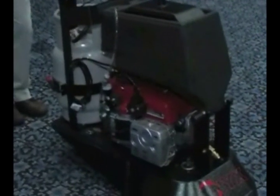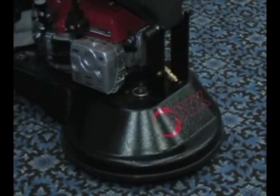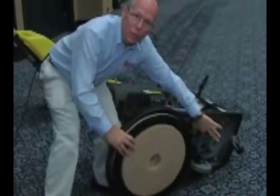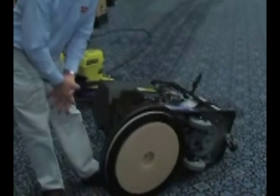An interesting piece of equipment that's come to the industry is the Carpet Avenger — it's a propane-powered carpet scrubber. You may be familiar with propane-powered floor buffers that spin at 2,000 RPM. Well, this has been geared down and modified for carpet scrubbing for large applications. We're able to clean at 6,000 plus square feet per hour, pumping the detergent onto the carpet from a SureFlow pump built into the system. Under the machine, we have a fiber plus pad and a three-inch brush row making a 21-inch scrubbing pass, geared down to 200 RPM. Truly an amazing piece of equipment for large commercial areas.